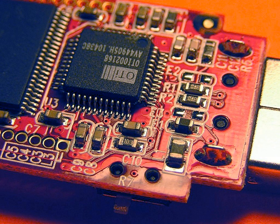Regardless of cleaning or not those PCBs, current industry trend suggests to carefully review a PCB assembly process where no-clean is applied, since flux residues trapped under components and RF shields may affect surface insulation resistance (SIR), especially on high component density boards. Certain manufacturing standards, such as those written by the IPC, Association Connecting Electronics Industries, require cleaning regardless of the solder flux type used to ensure a thoroughly clean board.